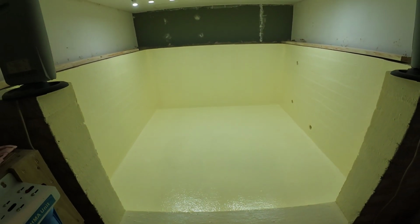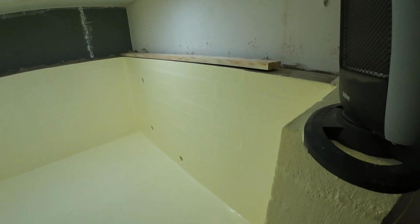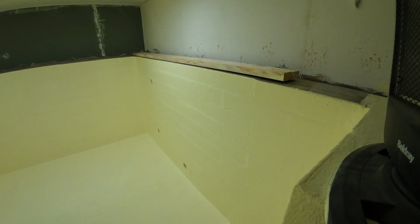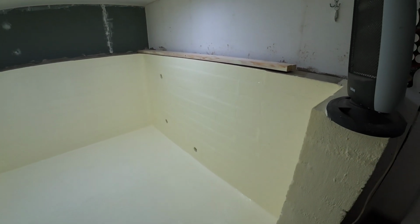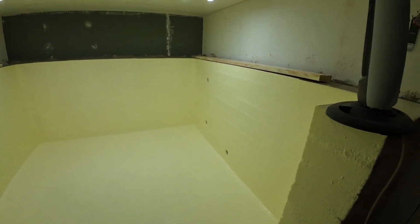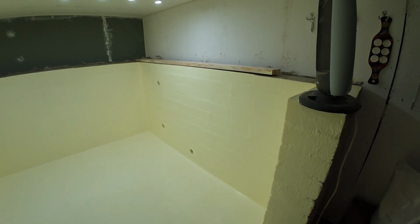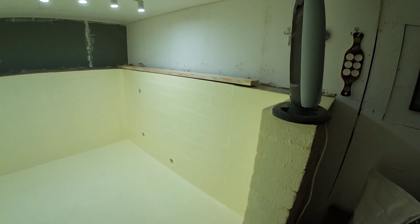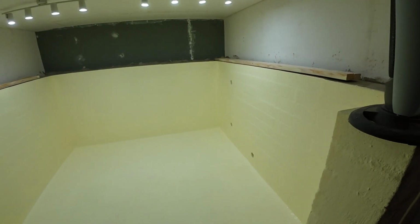So yeah, we're nearly there, guys, we're not far off. Like I say, I've got my scant there, which is 75mm by 38mm, maybe 40mm. That's for the window frame to sit in, or for the window to sit on, should I say. That's going on the return on the inside, all the way around and back up. We're going to fix that with anchor screws to the wall. And then I'm going to order some extra pond paint, paint the timbers, because you can actually paint wood with it, and then we'll be ready for the window to go in with the MS 300.